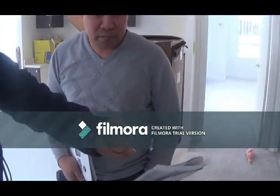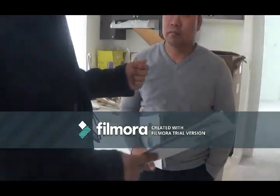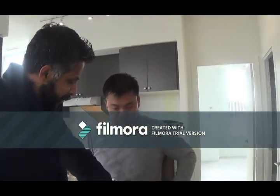One thing I noticed, maybe you can talk about, is adjusting the float manually. Yeah, it's easier to show it to you because everything's closed there. Your makeup valve, okay? So when you open the door, remember where I showed you the pipe? When you open the door, you won't miss it. It's right there on your left side. It's basically a float valve, same thing that you have in your toilet. When you lift the toilet lid, you see that float. Same concept.